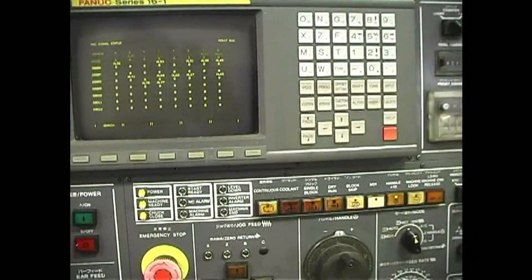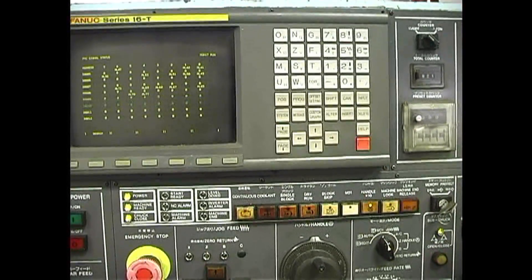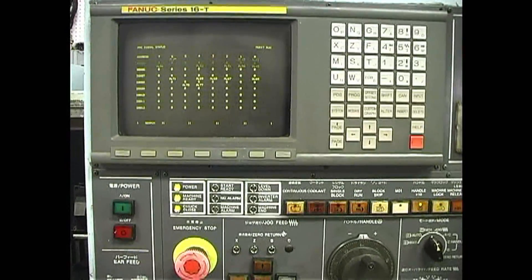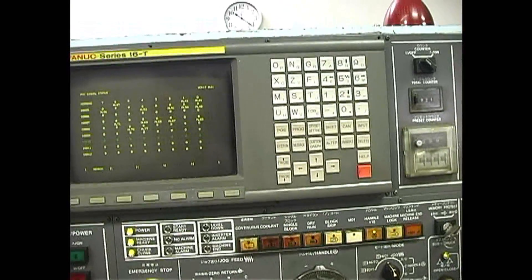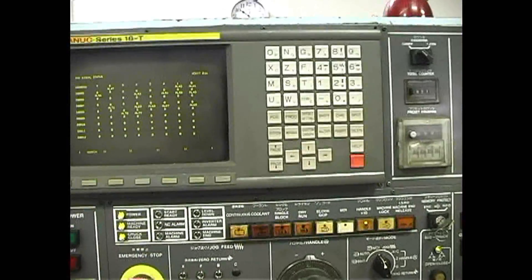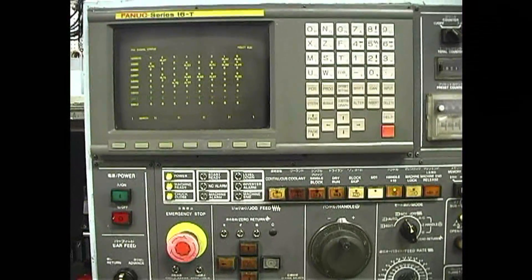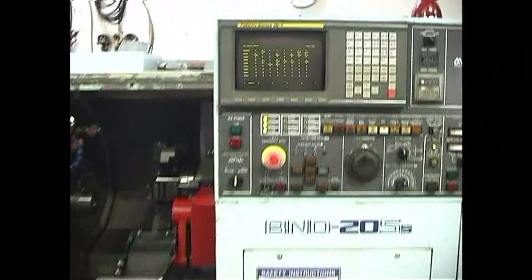So that's how you get to the machine alarm diagnostics, which is different from the FANUC alarm. If you get an NC alarm, that's a different thing — not the same. For a machine alarm, you have to look in the D addresses on a 16, 18, or 21 control or i controls. And that's it.